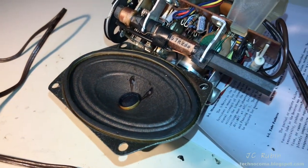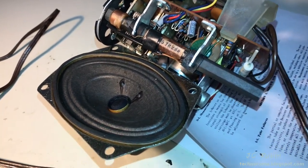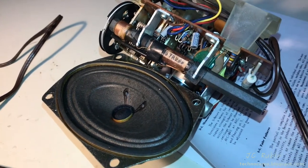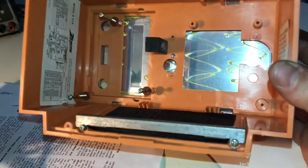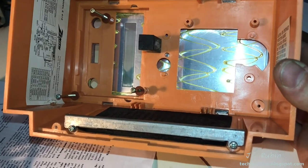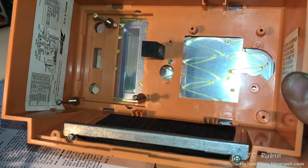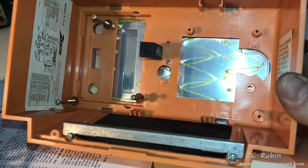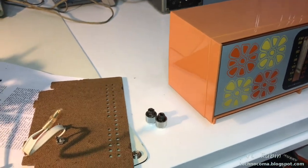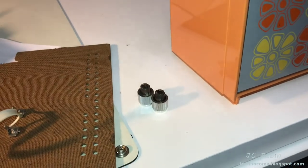I found it necessary to remove the speaker with the radio. It was easier than having to cut the leads to the speaker, which are soldered to it, with a very short amount of distance between the wires. I put all the brackets and screws back in their original positions after I took the radio out of the chassis. Not only will it make sure everything goes back in their original locations, but it'll ensure that I don't lose them while I'm working on the radio. These pieces can now be moved away where they won't get scratched or damaged. I don't have to work on this stuff, so I don't need to be on the bench. Maybe the knobs, but not right now.